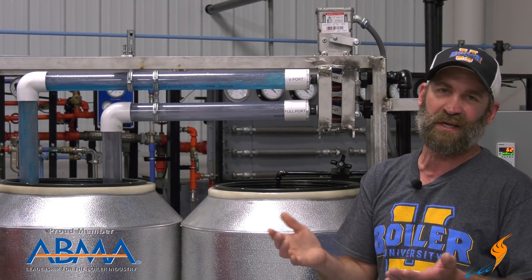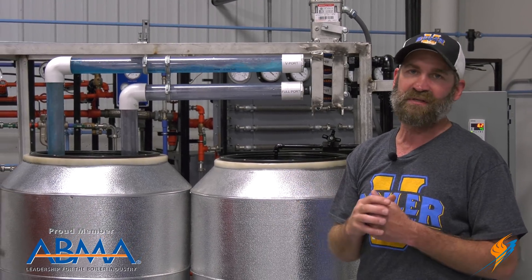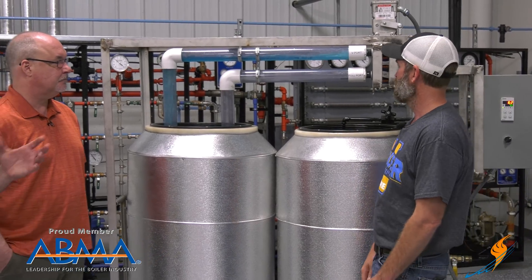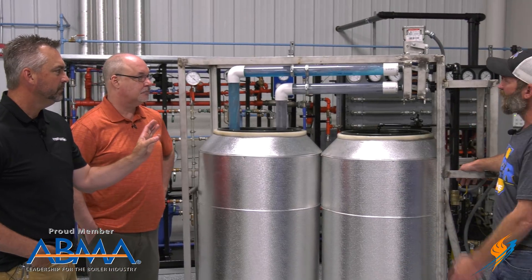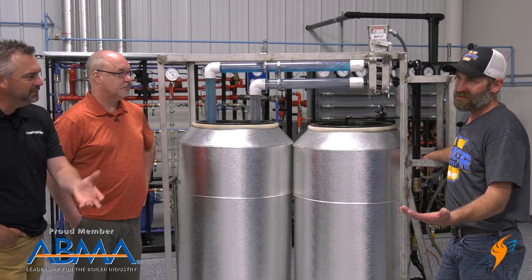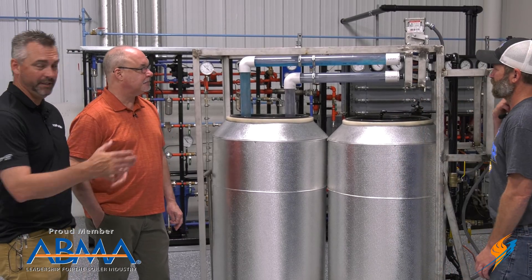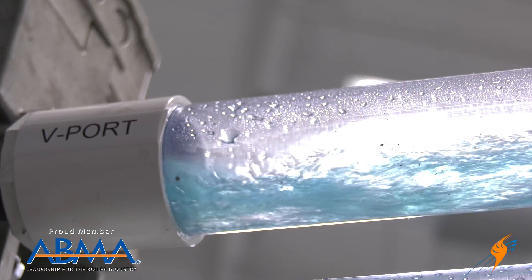At 50% to 75%, that's going to be our range of control, and that's where we want the boiler. If we can range between 30% and 50% on modulation, that's where we want the boiler to run — not closed and open. What type of pressure are you actually running here? On this demo we're running right around 70 PSI on this little pump. Typically in the field, most situations you're going to be running anywhere between 100 to 200 PSI on feedwater pumps, which really amplifies what we're seeing here once you get out into the field.